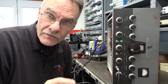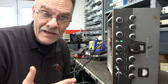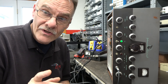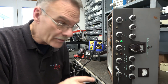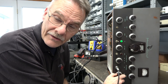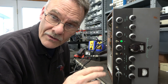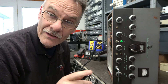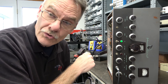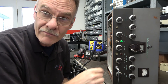If you think you have a phasing problem, there's a real easy way to tell. It may not necessarily be your audio — it may be when you're not transmitting at all. If the phasing is wrong on that transformer, simply advancing your audio gain will be an indicator. If you get up around 7 or 8 on the dial and you start seeing modulator current and you can hear a little bit of a hissing sound, you've got feedback going on. To take care of that, you can swap the two green wires underneath, or you can swap the two plate caps on the 807s and it'll go away.